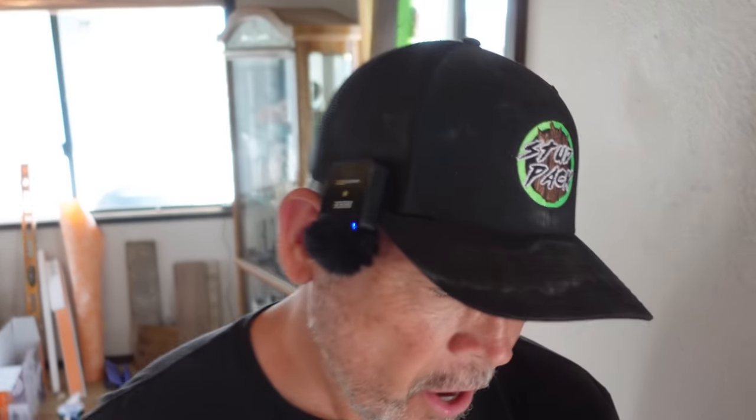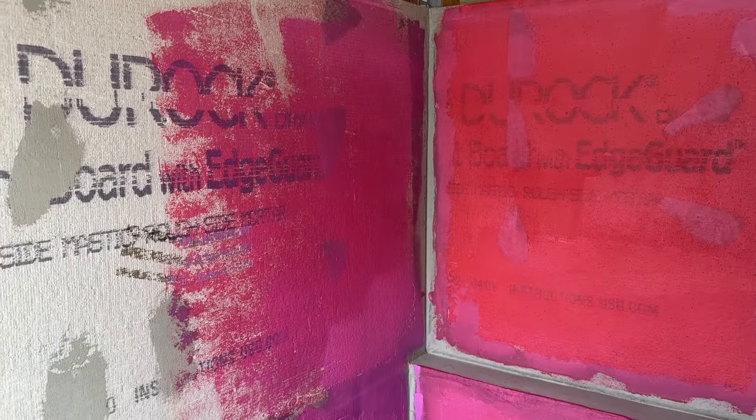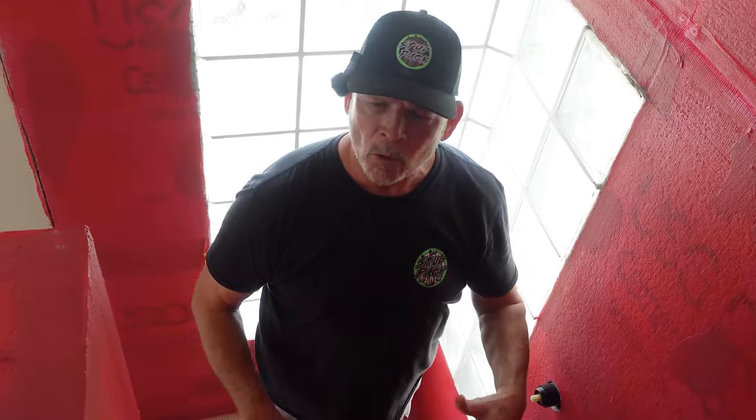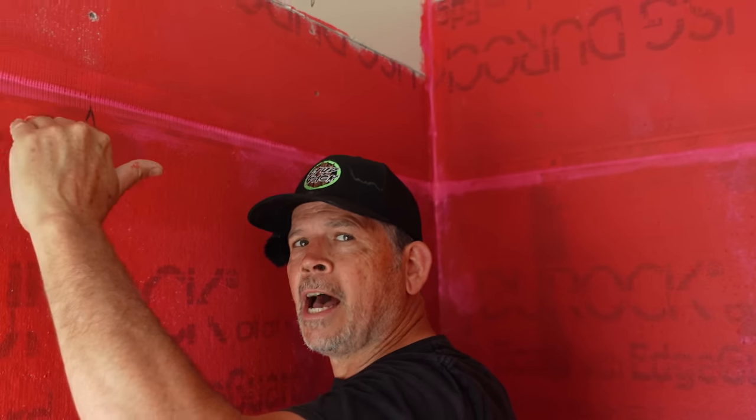It is the next day on our bathroom remodel here on the beautiful island of Kauai, and we've already been kind of hard at work this morning. Putting up RedGuard is really just as simple as painting, but we like to put it over backer board as a belt-and-suspenders approach to keeping water out of our structure and from leaking downstairs. We could tile directly over the backer board, but it's cheap insurance and it goes really fast. Our next step — believe it or not — is to start tiling. We actually counted all our tile: if we go six courses high I would need 47, and we have 70. We're going to go all the way up this whole wall and this whole wall with tile up to about here. It's going to look killer.